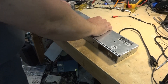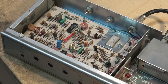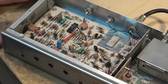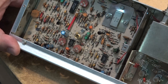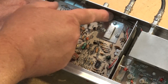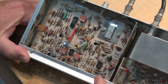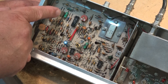Let's take a look inside — I've already got all the screws out. Inside the unit we've got our modulator. This is an IF modulator so it's going to modulate down at around 45 megahertz. Here's our AV modulator circuitry. Video comes in here, and audio goes underneath via a wire that comes around up to the front. Here's our baseband modulator, crystal controlled for the IF frequency.